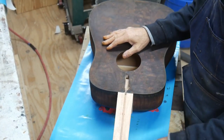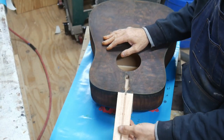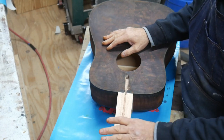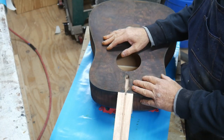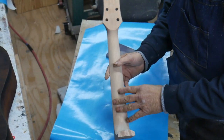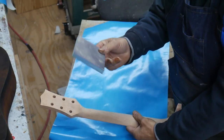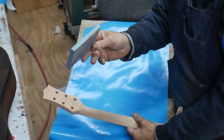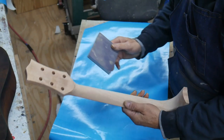Now what I'm going to do is pull this back off and sand it a little bit, because I'm not going to paint the neck. I'm going to put some oil on it and make it really smooth — I don't want to paint it with any lacquer. I like these sanding sponges; you can get these online or at a woodwork shop. This one is 320 and 240.